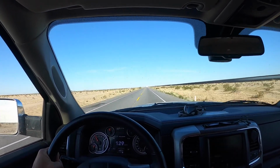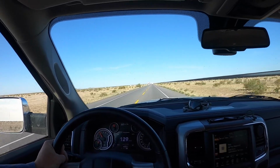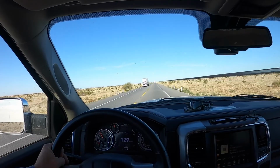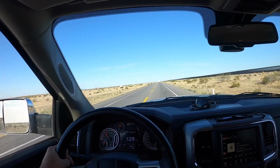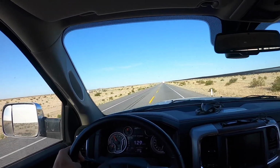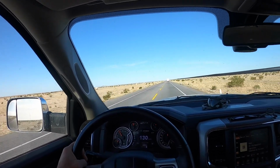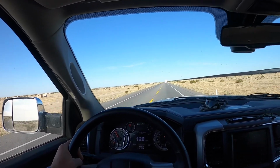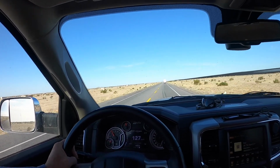So I have packed up on the truck the mainsail because you can see it's a little too short. We're going to solve that, ship it back to Vermont probably where it was built. And the jib's up on top, the battens in it. Get a little bit of wear at the batten pocket ends along the leech where it sometimes comes in contact with the spreader because of the rotating mast. So we're going to do some reinforcements up there.